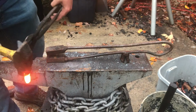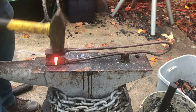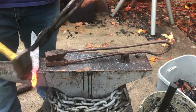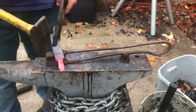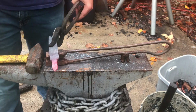And basically all this swage is two flat pieces of metal that meet up in the same spot. And I can strike it with the hammer, and as you can see, it flattens them equally on each side. And this just helps me to get a cleaner transition, a more square transition, before I go into grinding, so that I waste as little material as possible.